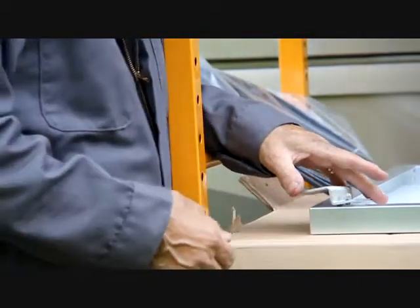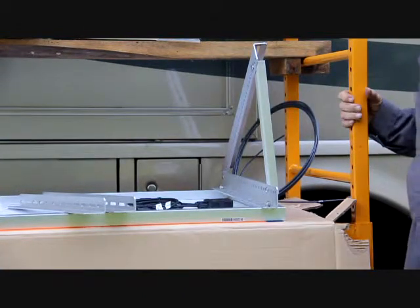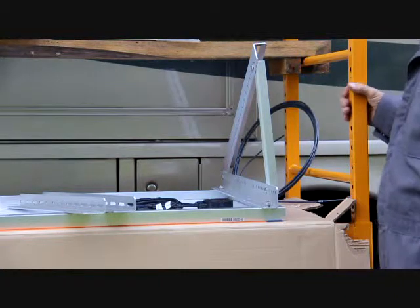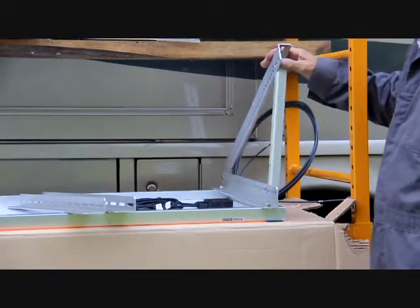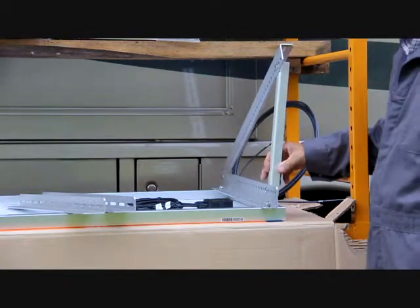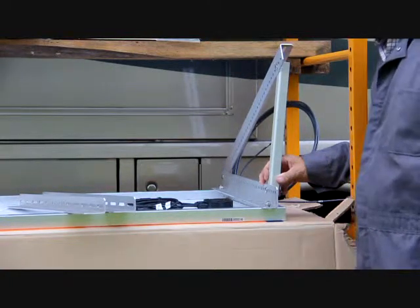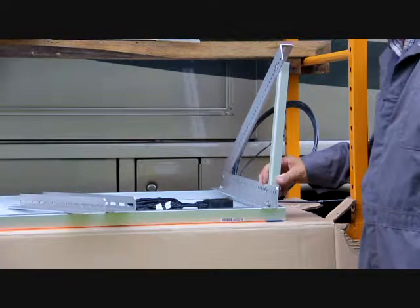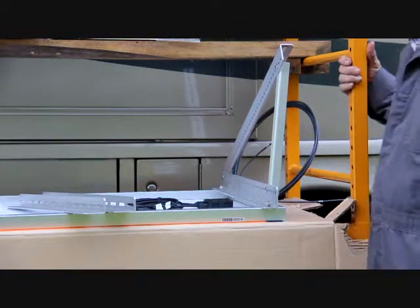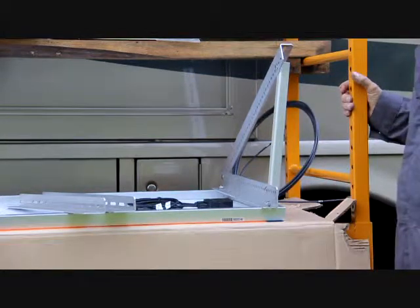As an optional purchase, I would suggest buying these brackets that allow you to tilt your solar panel up toward the sun. 90 degrees to the sun is the best, and you'll be surprised at how much more energy you'll get from it when you do that. If you don't want to climb to the roof, then just leave it with the flat Z-mount brackets.